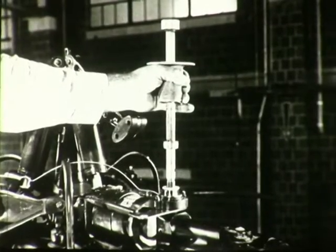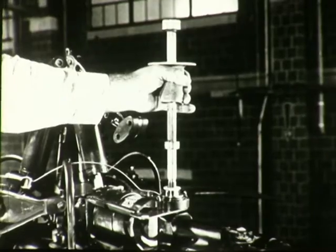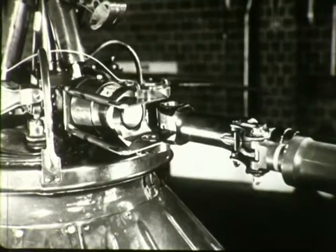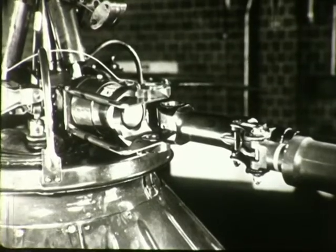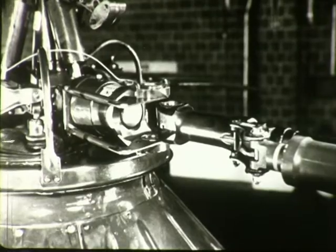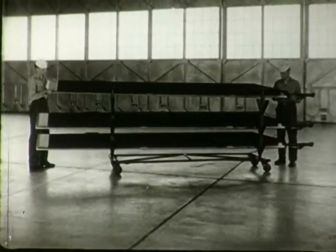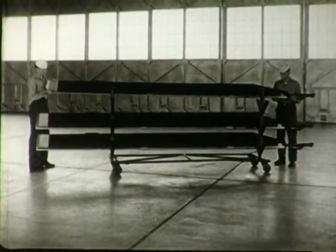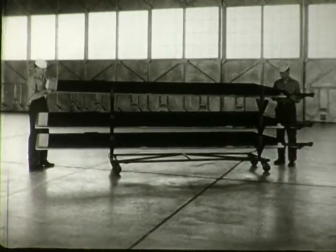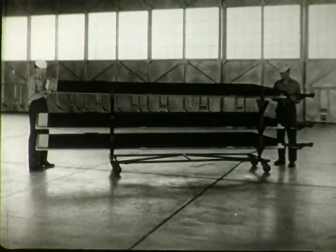Remove the vertical pin from above using the puller specified in the erection and maintenance manual. Remove the blade by sliding its root end horizontally out of the pitch bearing housing. All blades, when removed, should be lowered to the deck carefully and placed in a blade rack. Now you are ready for the next removing operation.